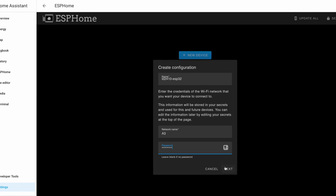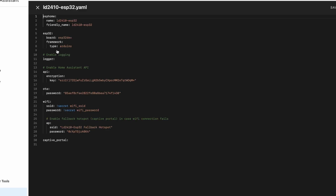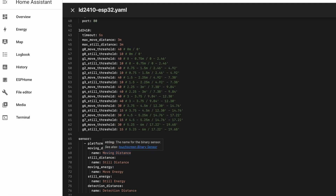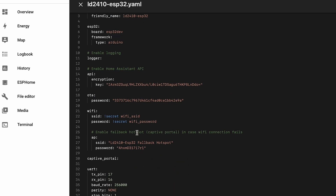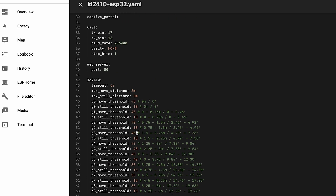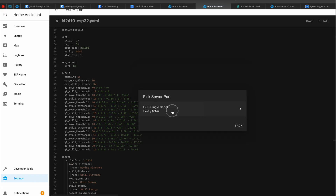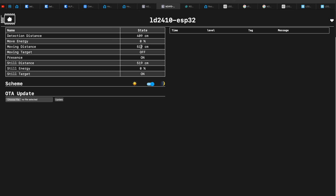I will not install it yet because I want to edit the ESPHome configuration first. As the ESPHome configuration I will paste the following YAML code. This code is provided thanks to the ESPHome documentation and Larry from my subscribers who wrote me about it. You can get the code from the video description for free, just like my smart home glossary. Once I have the code pasted and my sensor and ESP32 board connected, I will hit Save and Install.